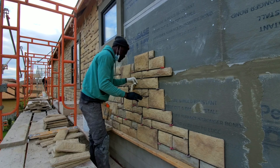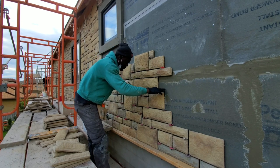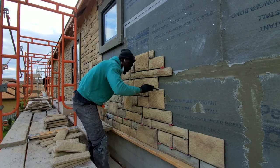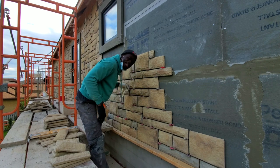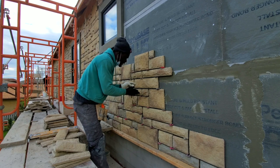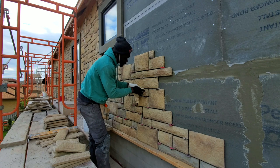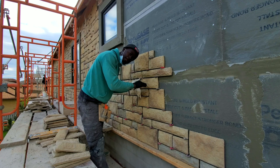If you don't take away anything from this video, remember: don't go no higher than the biggest size stone, and once you reach four feet or less, break it by putting a stone in front and start a new line — keep repeating the same process as you go. Try to prevent putting a medium on top of a medium. Once you have a medium it's calling for a small; once you have a small it's calling for a medium, to add up to be the same as the big one.